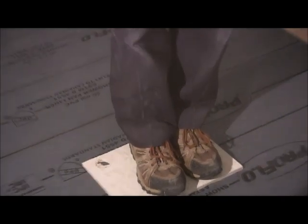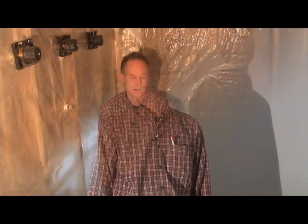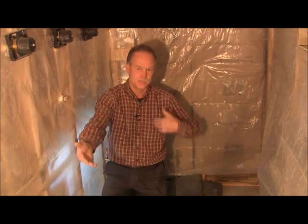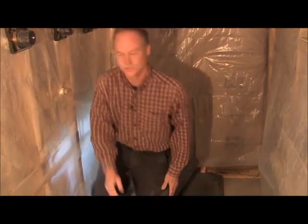After this is dry, we'll be ready to put our liner in, and so I'll see you in there in just a minute. Okay, we've carried our membrane in here, and the way I carried it in, I folded it up on the dotted lines that I'd made, end for end, and then on the sides. Something you're going to want to make sure you do is vacuum, clean this floor real good. Your first layer of pan, you want to make sure it's nice and clean, and then you can just bring it in and unfold it.